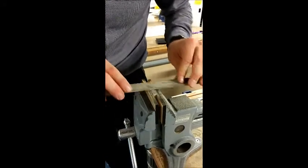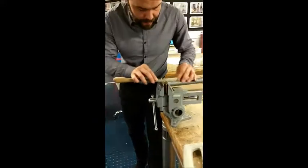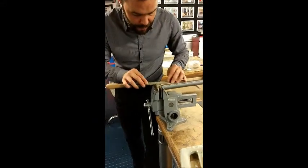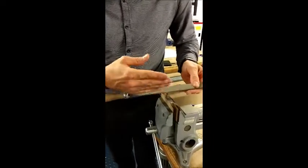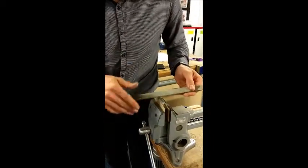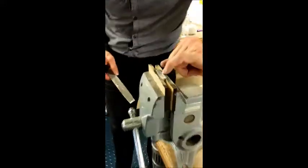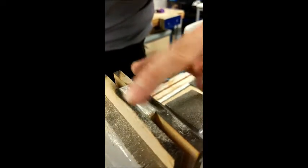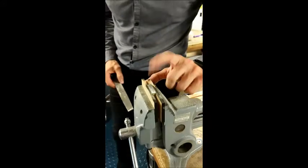If we look at the top of the work you can see those scratches are now going in this direction — they're very, very fine. I'm going to keep going until I get a very consistent pattern on the top. If I was skilled at draw filing and had a range of different grades of files I could almost use filing alone to get to a very smooth finish. That finish I've got there is pretty good, so I'm going to use some wet and dry paper as my next stage.